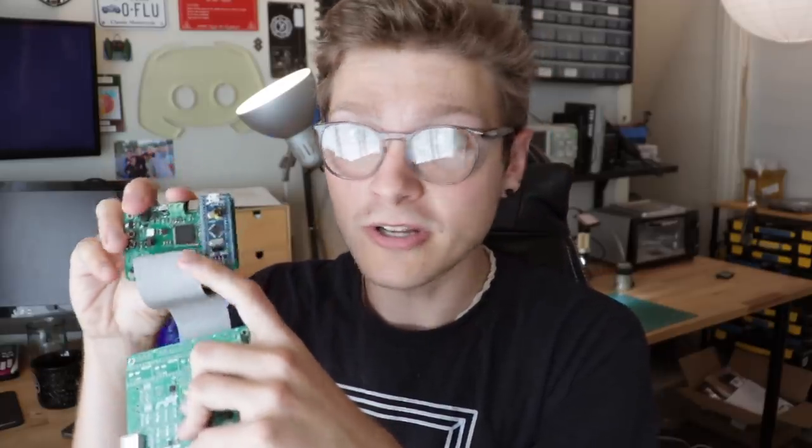After that's done, it'll start sending certain serial commands to the controller board that gets it to run different tests. The Python script will walk the controller through running all these tests, and it will receive back the result of all those tests. And then after the Python script is done running all the tests, it'll then flash Marlin onto the target board using the blue pill, and the board's ready to rock right out of the jig.